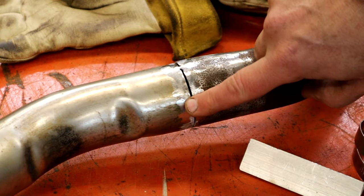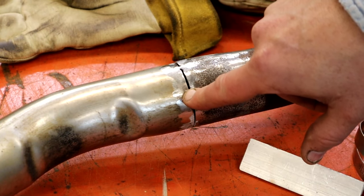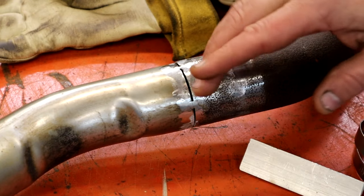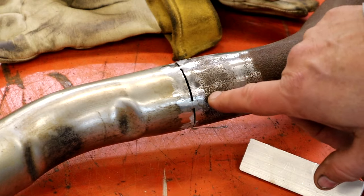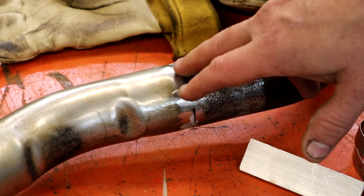When you do this hot one and you start seeing the orange glow go away, you nail it about halfway in between again, let the orange start going away, and just keep doing that. If you can keep your spacing right, you'll have a kind of stacked-dimes look. What gives it away is where the wire pulls out. You'll have a little pinhole right there.